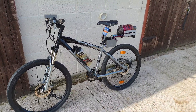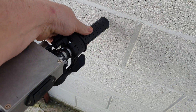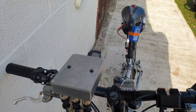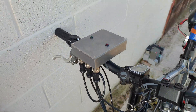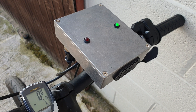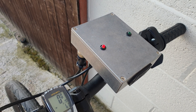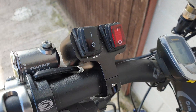From the start, I'll give you a quick run over how everything works. For the throttle, I've got a motorbike electronic twist grip that goes into this little box, which contains a linear pot to PWM output circuit that drives the ECU of the jet engine. A red light means power, a green light means it's running. When you want to stop, you kill the engine with the run switch, which then does the cool-down cycle whilst there's still power, and that is operated from these two switches.